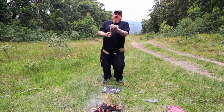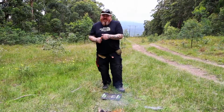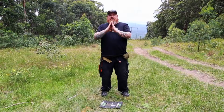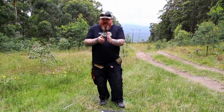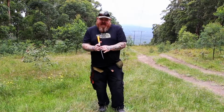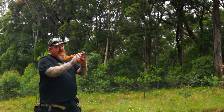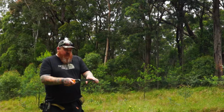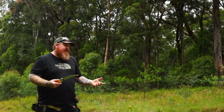Blade thickness, I think spot on. Now in Australia our blades are different to everywhere else because our wood is different to everywhere else. Our blades angle this way, whereas I'm not sure, but I think everywhere else in the world they're just a straight blade, but don't quote me on that. But I know through speaking to the girls up there at Silky Arbor Lab that all the saws that come into this country have that angle. It's just because of that super dense hardwood. When you're doing those pull cuts, you're putting pressure on the wood as well. It just closes in more than a softwood would.